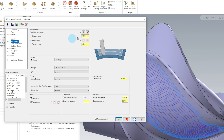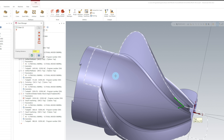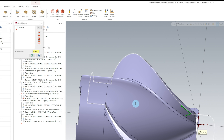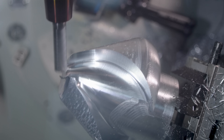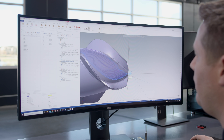We hit End Selection, and for floor geometries we simply pick the floor of the hub. End Selection. I'm going to leave 25 thousandths on the walls and 15 on the floor. Roughing, Dynamic Strategy, we're going to be doing a step over of 75. Very important here — in the area, we're going to use a containment. I've created curves around the outside profile of these fins. I want my tool to drop down where there's no material and work its way in, so I don't have to plunge or helix down inside of material. I've extended the curve out far enough so the tool can reach all the material. So now that we have a containment chain, we hit Generate. And there's our pocket.